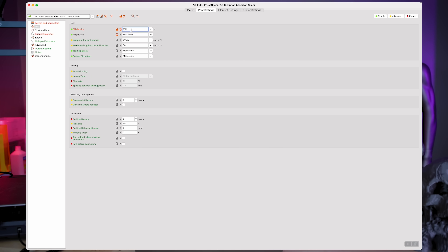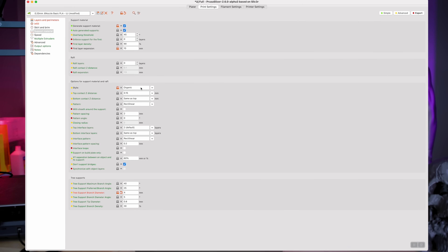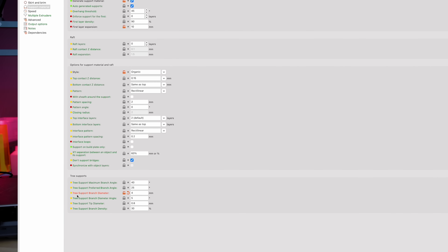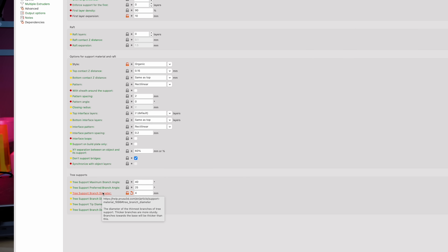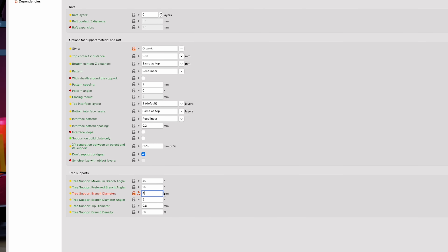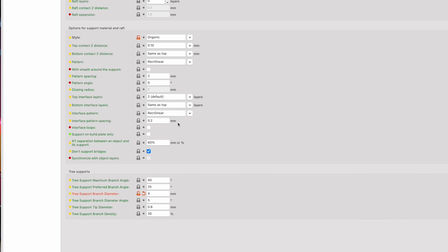For infill, I like to leave it really low — somewhere around 5 to 8% — since we're going to be extruding a ton of material, making prints nice, thick, and chunky. The last setting I wanted to call out, and another reason I've switched over to PrusaSlicer specifically their new alpha release, is for organic supports. That's going to really help cut down on the amount of material and print time when you need supports. Enable organic supports, and also consider bumping up the tree support branch diameter, especially when printing really large objects, so you don't get thin branches that become potential failure areas.